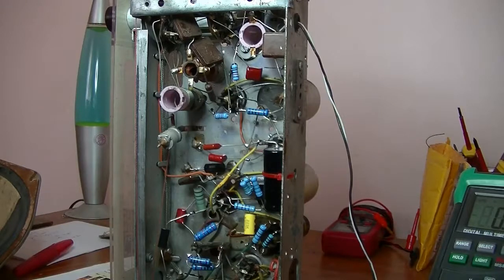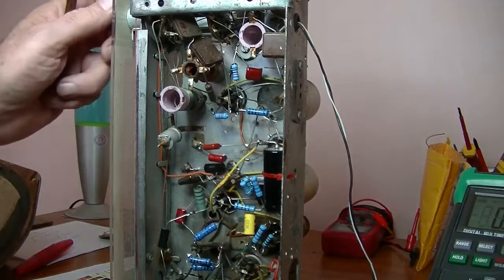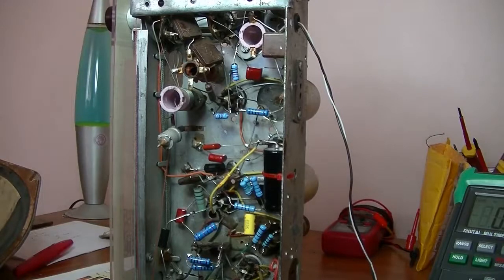But of course, when you're working on these, be safe. The voltages in there will kill you. Hence why I never, ever touch a chassis when the radio's got power running through it. Never. So I always put knobs on. And I'm a good boy. I discharge capacitors before I touch them. And that's what you should do. Have a nice, good, solid set of safety procedures. Do it every time. I can't say that more than enough.